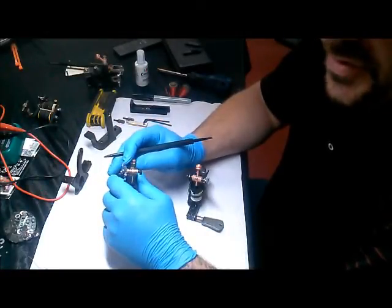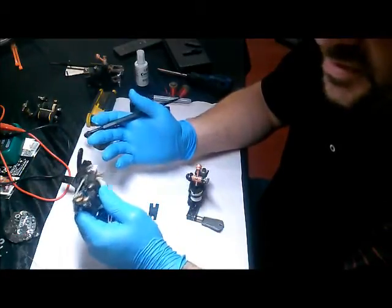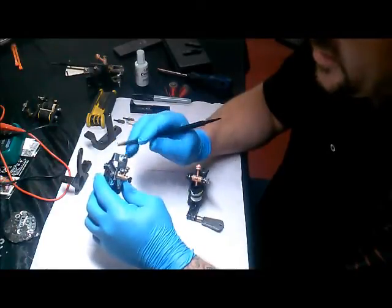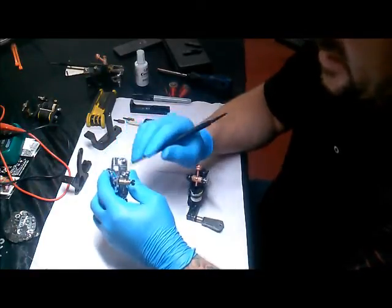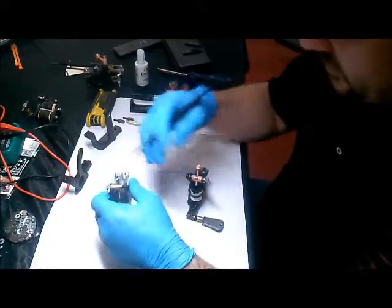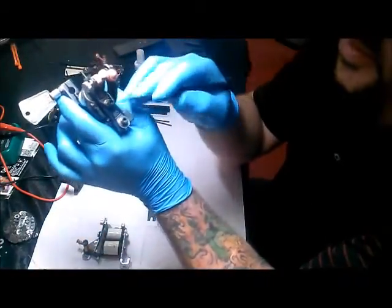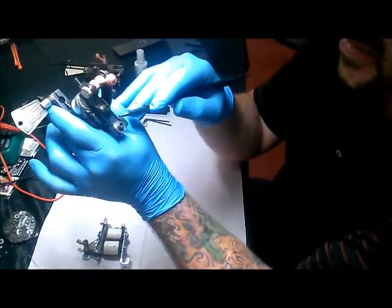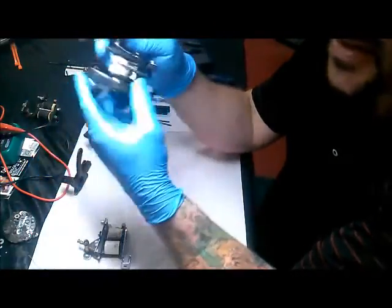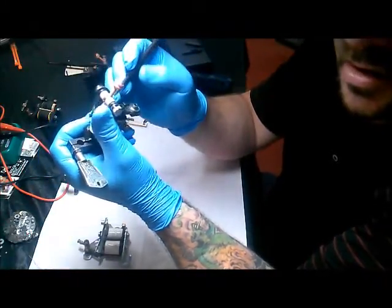Generally for a liner, what I do is put a 20 gauge on the back or an 18 gauge, and a little bit lighter on the front. Say I put a 20 on the back like this one here and a 16 gauge on the front. That's typically 20 or 18 is how I'll set it up, or I'll do 18 and 16, something like that. It just depends on what I'm trying to achieve with my tensions and my hard hitting.